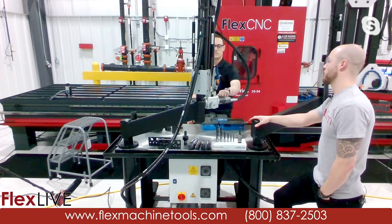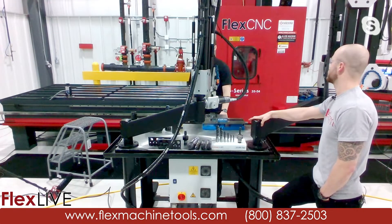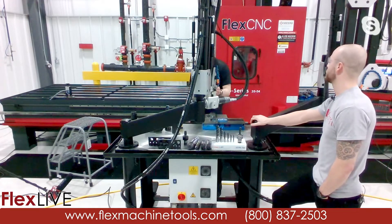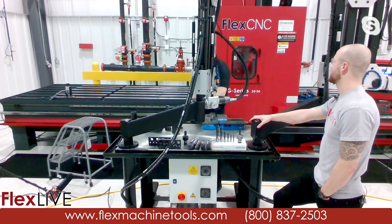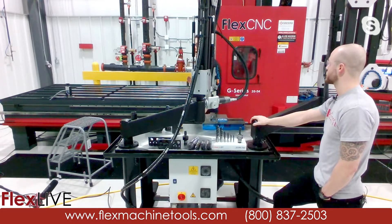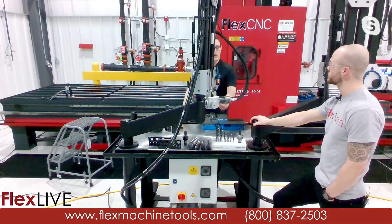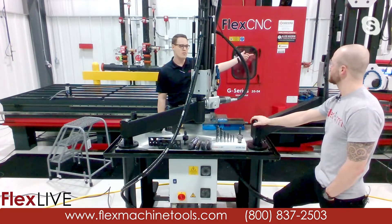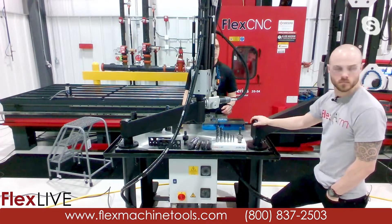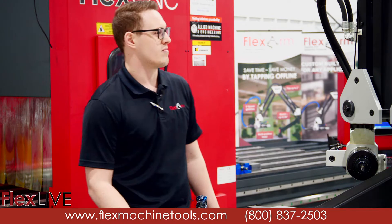What's one of the coolest applications you've seen using one of these arms? Some of the cooler ones are having a cart or table with casters on the bottom. I've talked with individuals who use an arm like this — as you can see we have our open-bed vertical machining center — and they want to tap with a tapping arm instead of bogging down the machine's cycle times. They bring the cart up to the bed of the machine and tap offline with the tapping arm while the machine runs other parts, no additional material handling needed since it's already fixtured.